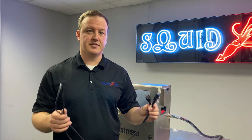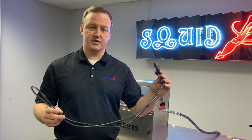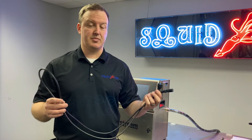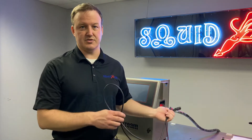One other thing we want to look at is just make sure our power cable is okay. Check your ends, make sure this isn't damaged or anything's frayed. And again, if you're qualified, you can meter this out too and just make sure that it's okay. Something really simple to look at and something you don't want to overlook if you're having issues turning your printer on.